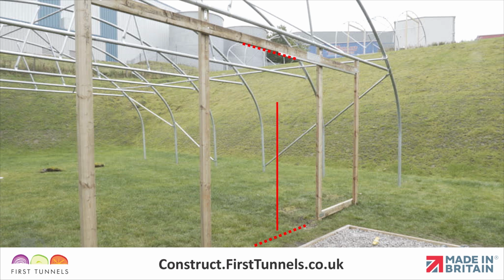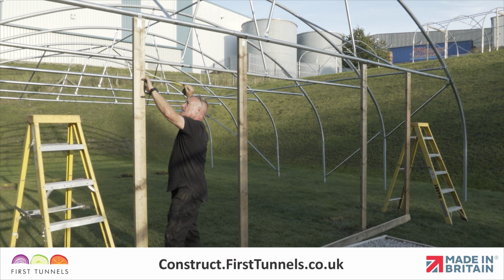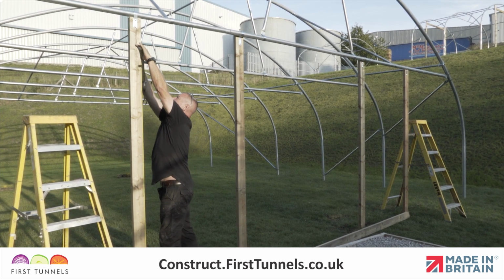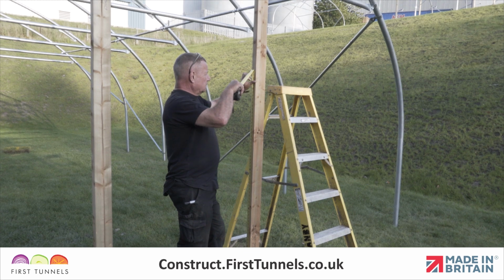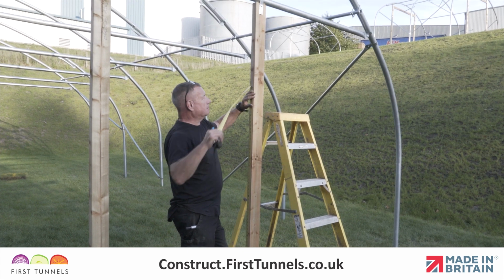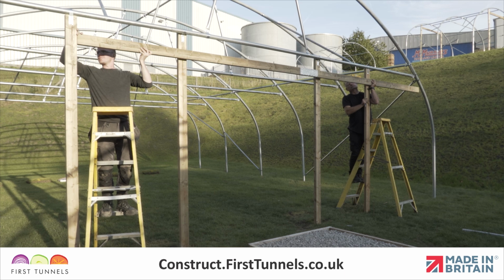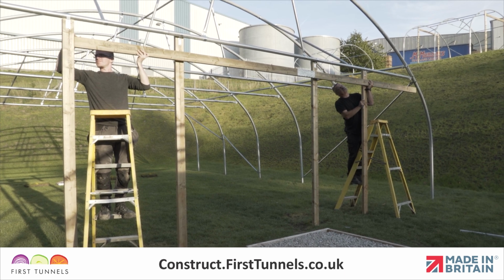The door frame lintel should be at a height of 2.17 meters from the ground to the bottom edge of the lintel. Measure up the doorpost 2.17 meters. If your site slopes across the width, measure up the post on the higher side. Offer the door frame lintel up, position one end flush with one doorpost and make a mark at the other end and cut.